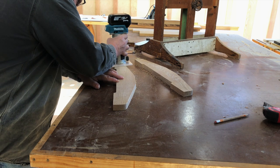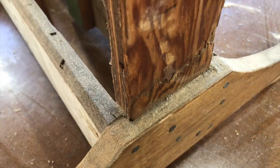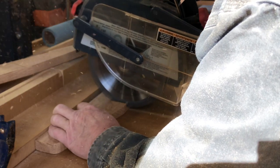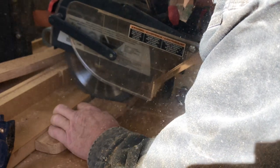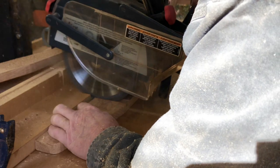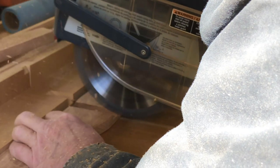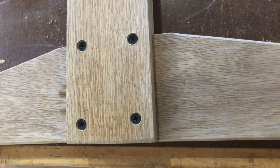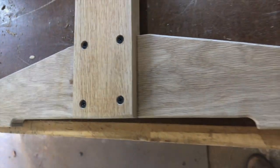You can see here on the original that the builder created a lap joint where the sides meet the feet. It'll be strong whether you do a lap joint or not. I happen to have a radial arm saw set up with a dado blade that I use for cutting rabbets and dados - it's dedicated to that purpose, so it's easy for me to cut out the wood for the lap joint. But again, you don't have to. I have glued and screwed this joint together, and I'm going to use construction screws mostly as I assemble this, but I'm not going to glue any other joints just yet.